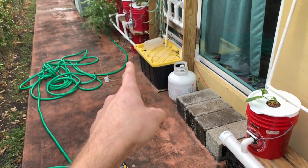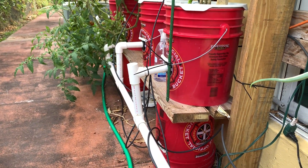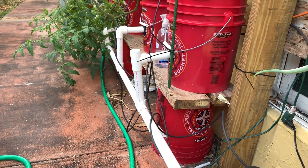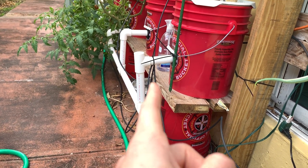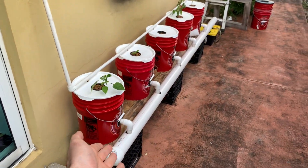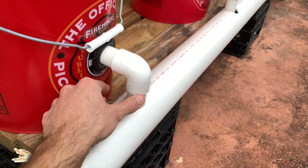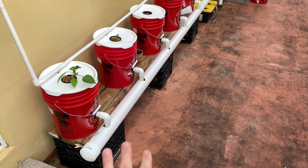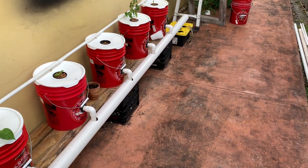The reason I went with three-inch tubing rather than one-inch is pretty obvious: look how crooked the old one is, how many connectors it uses. The old setup is much more prone to leaking, clogging, and backflow, and it makes the bucket difficult to remove. With the new setup, the bucket just lifts right out, there's significantly more flow, far fewer connectors, and only one cap at the end.